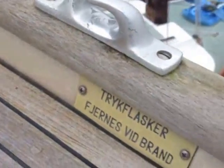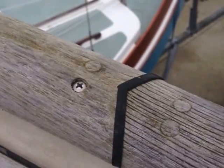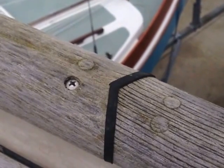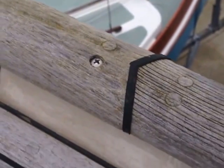On this particular boat there are key items that have come to light. You can see here a good illustration where the teak — in this case the teak capping or toe rail — has been secured. Teak caps are then placed over the surface, and you can see some of the caps are missing. The other key area that we look for is the sealant, or caulking as it's called, between the teak planks.